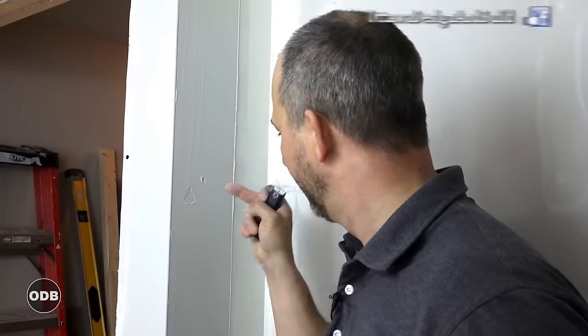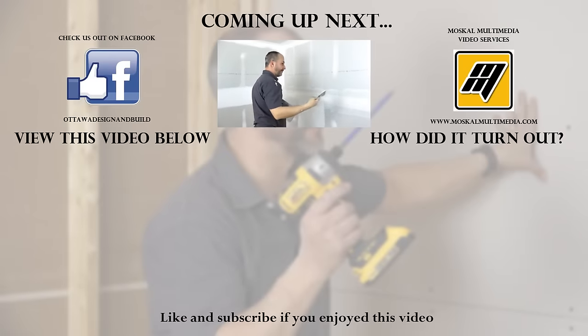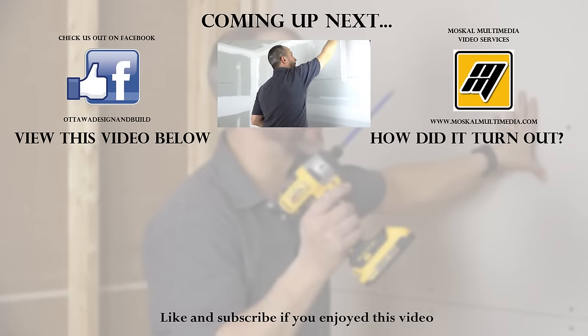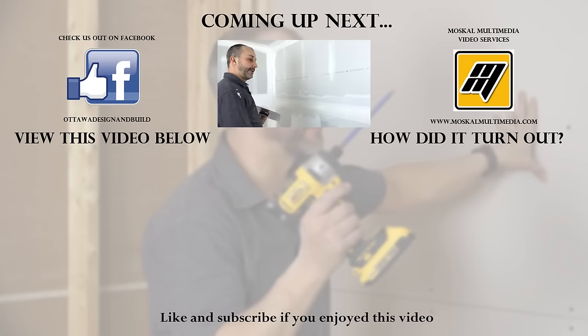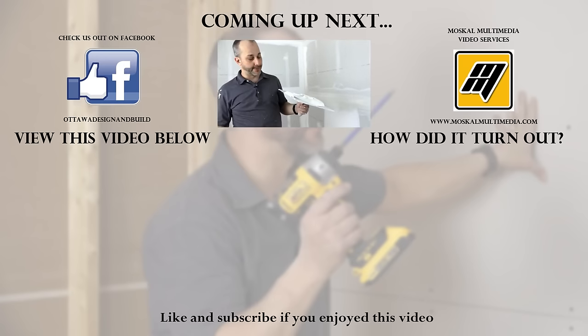The only thing left to do on second coat is to hit your outside corners with your finish mud. Here's what you do: stick your finger in it — if it makes a hole, it's not dry. Leave it alone until it's dry, then we'll do this in a few minutes. If you're enjoying these videos, subscribe to the channel, hit the like button, but most importantly, comment on the videos with any suggestions for videos you'd like to see. We'd love to be in touch — see you next time.